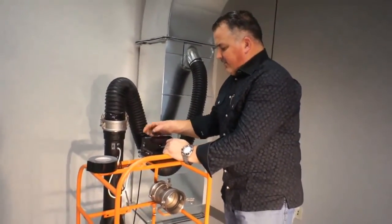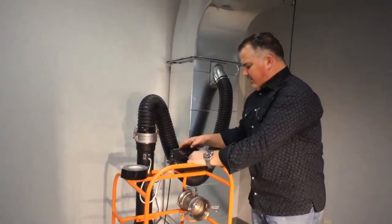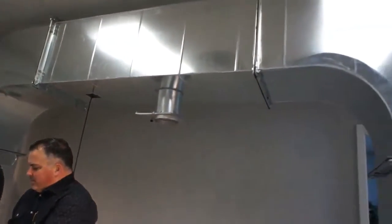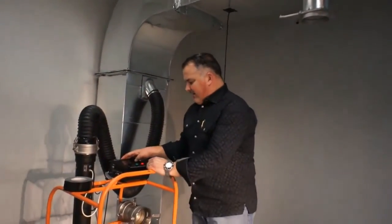These are all the configuration questions. We're going to use the SMACNA US standard. This duct is class 2, which we're going to be testing. There are 30 square feet of surface area — we've calculated that already for our duct.